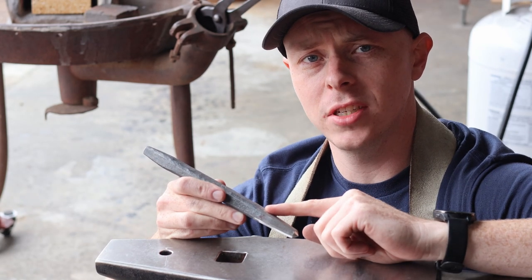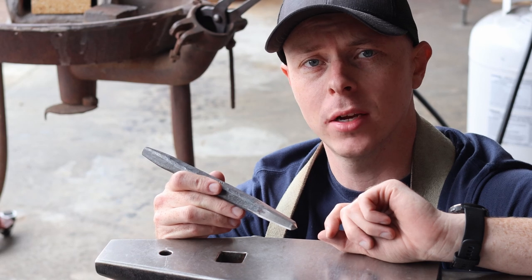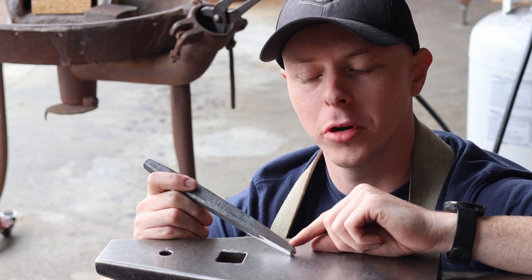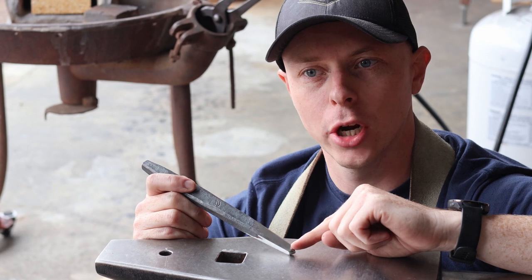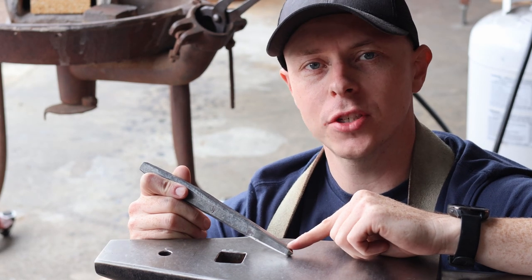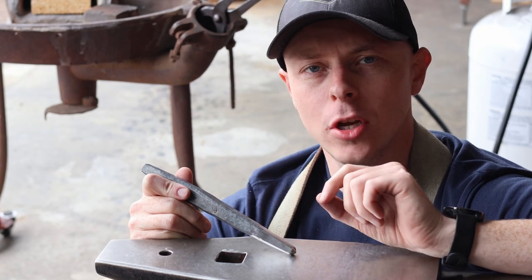The basics are: bring a little more than just the tip to a dull orange, then quench the first half inch or so in water, and let the heat from the body of the punch bleed back forward toward the tip to temper it in the same cycle — so I don't have to do extra tempering in the oven. The reason I polished the tip other than aesthetics is so I can use an old grinding wheel to scrape off the forge scale and watch the tempering colors run forward from the still red-hot portion of the body toward the cooled tip. Once the tip reaches a straw yellow color — that's my tempering heat in the 400 to 500 degree range — I quench and repeat for a few tempering cycles. I tend to work pretty fast during this, which is why I'm detailing it now, so watch me do it and come back to this segment if you need to review.